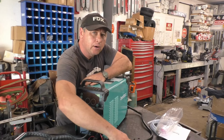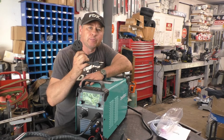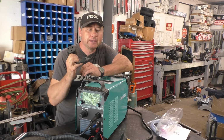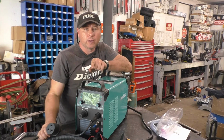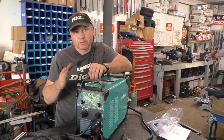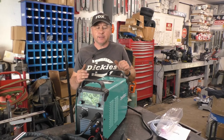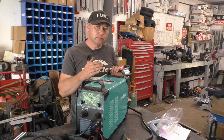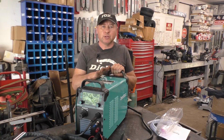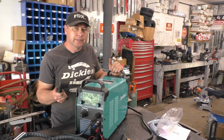It also runs on 110 volts with this adapter plug. But remember that you must have a breaker of 60 amps to run it properly on 110. And I believe you need an 80 amp breaker for running it on 220 at full bore. If you want to use the full 80 amps, make sure your fuse panel is set properly for it. Mine isn't today, so I will only be able to use it in 220, not 110. I realize that it did not work that well on my 110 plug through my fuse panel, so that's why I'll be using it in 220 only today.